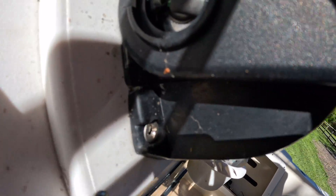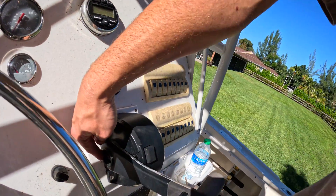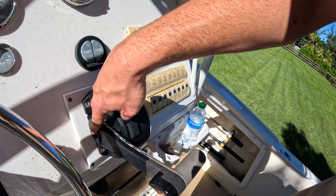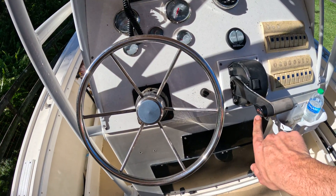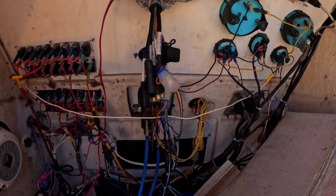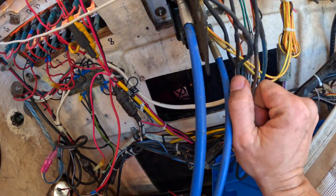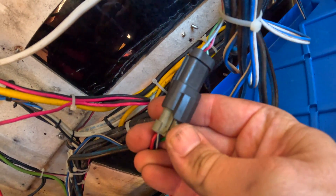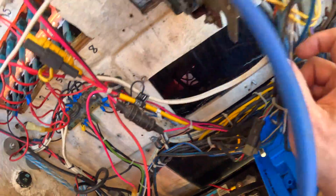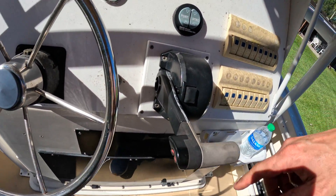So in a case like this where the wire gets broken, what you could do is cut it back to where it's cleaner and solder a wire there to make a new connection. Or you could just buy the little switch set, replace the switch, and run the wire that goes down to here. This black wire here goes and unplugs right there — you can see that. So you would just have to run this wire back up through the controls.